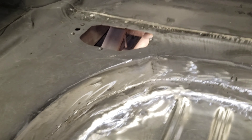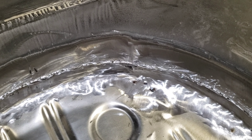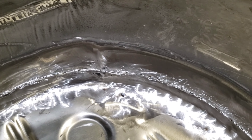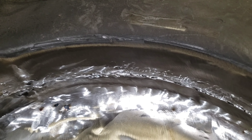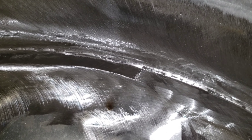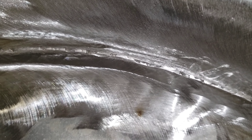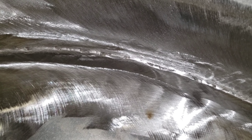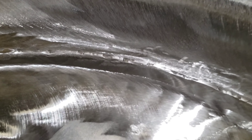I've checked all the way around and removed the light all the way around underneath it to where I could see if I had any pinholes showing, and I have not seen any. You can see there's some little dark spots where the weld is — that's just because I didn't bother getting the weld ground down completely smooth. I just roughed up the top of it good. I'm going to get a wire brush and clean all that out of there.